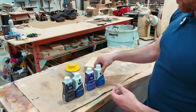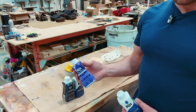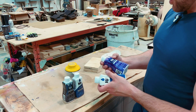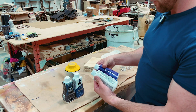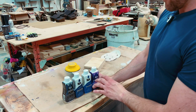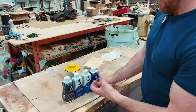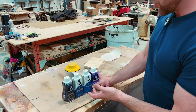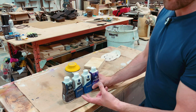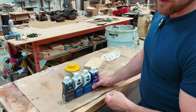And then a couple of bolder colors, the royal blue, let's see what kind of depth we can get out of that, and royal purple, because purple dye is usually awesome. These should be interesting to work with. I know that they're gonna work just fine. I've tried them before, but what you need to understand, like I said, is these aren't really high quality wood dyes, so they might not last as long in the light. They could, I'm not really sure, but that's one thing to watch out for. And so using a UV resistant clear coat over them might help that, or hey, they might just fade a little over time. Maybe that's not the end of the world.